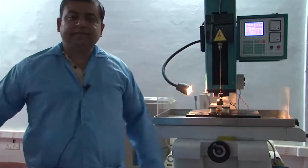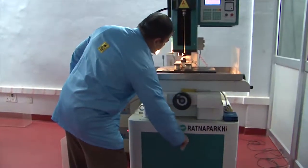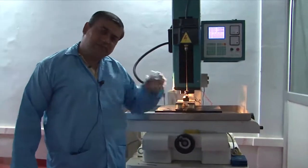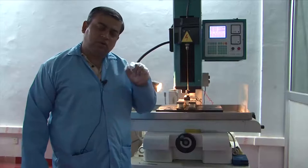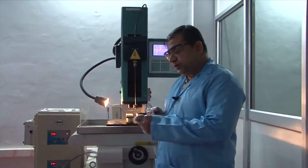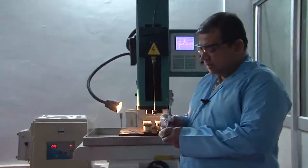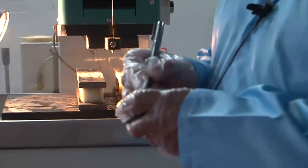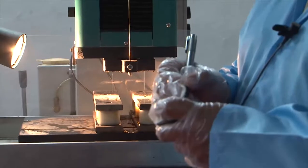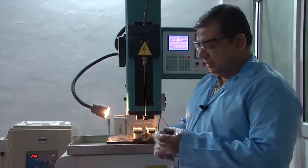Having covered the specifications, let me now step-by-step show the various aspects of setting up the system to drill a hole of about 500 microns diameter to about 35 mm depth. The first thing is to locate the hole position with a marker that is visible — a small hole has been marked in a certain region which is ready for setting up the machining system.